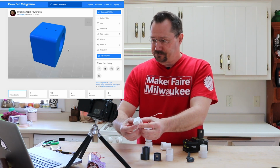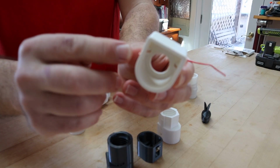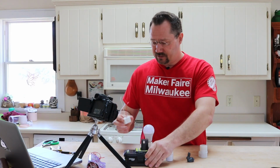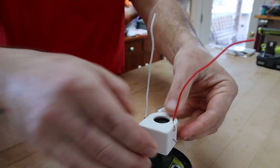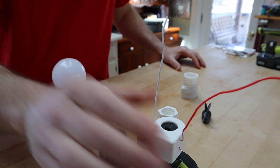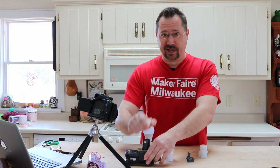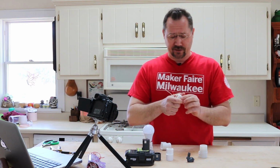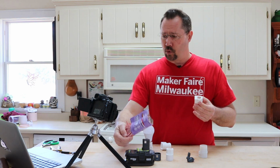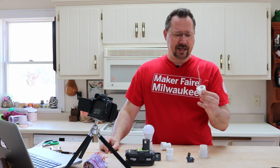And if you look at it, just the shape of it allows you to poke a couple of wires through, and then those wires go directly onto the top of the battery. And in fact, just the shape of it actually makes it fit on pretty nicely. So this is a great, very low-tech way to get power out of the battery. Now, of course, I want to be careful not to short these wires right here, and putting a fuse on there right away is a good idea. I just used some doorbell wire here, solid 18 gauge, and it seemed to work okay.